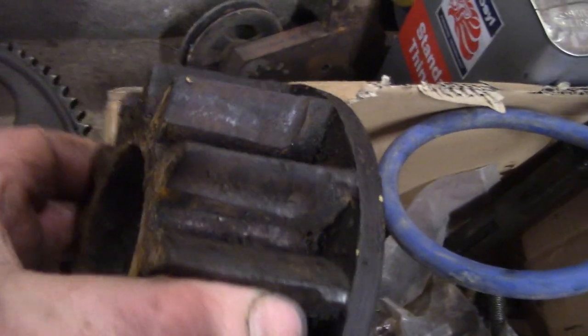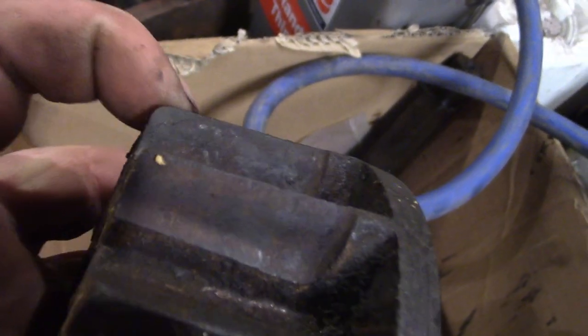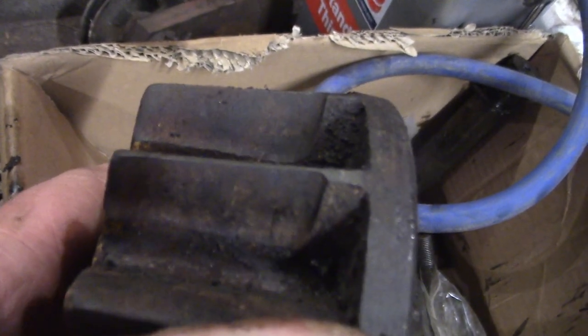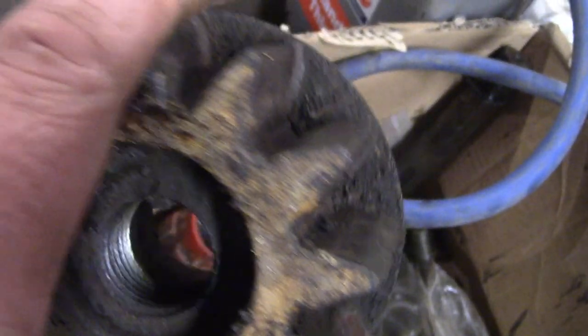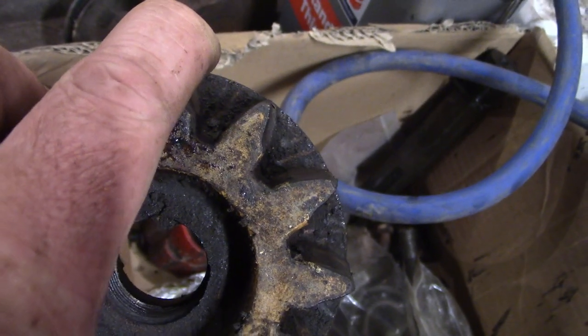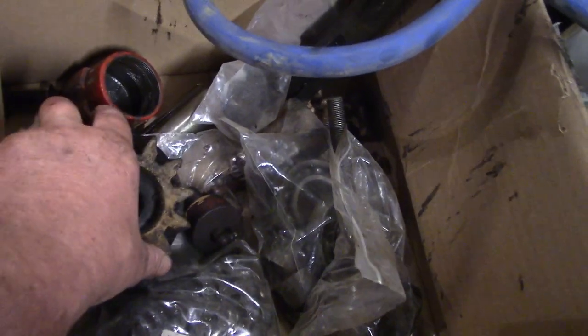I think I've got all the greasy bits cleaned up now - all the little bits and bobs. I've got my bearings and chains all bagged up. Anything that's not cast iron is bagged up with a little bit of light oil on it until we can get some grease on during assembly. I'm a tiny bit worried about this gear - I don't think the wear is that bad to be honest. Looking at the profile, it is starting to go but it's not so bad. I've been looking into TIG brazing but I don't want this to be my first attempt, and it will definitely work as is so I'm going to leave it for now.